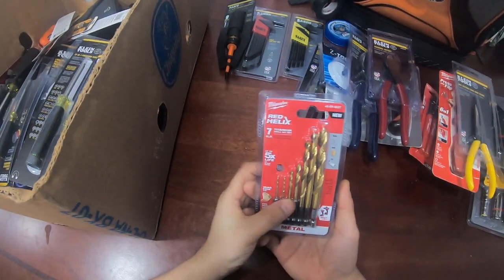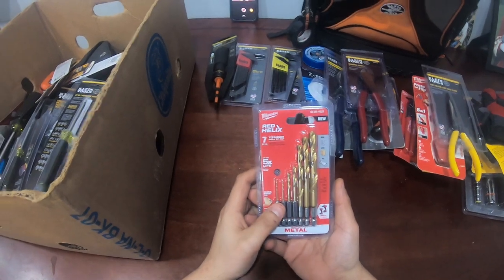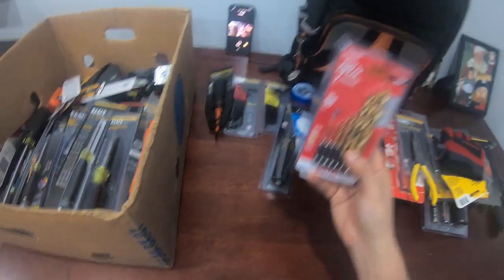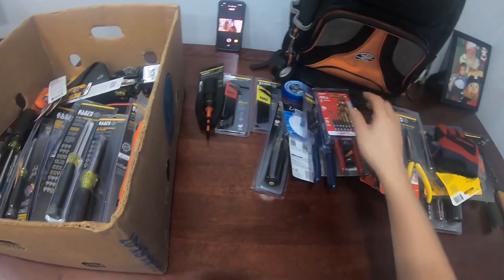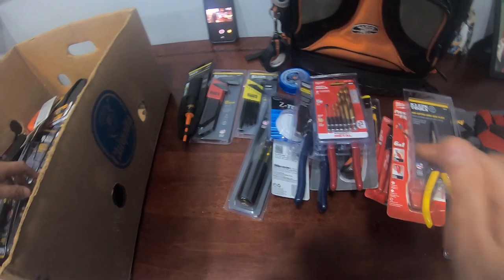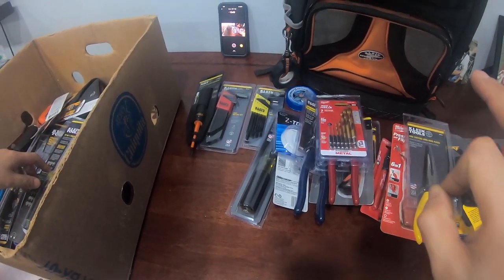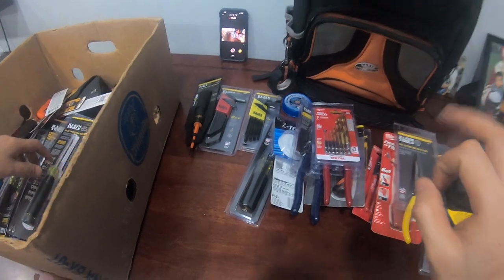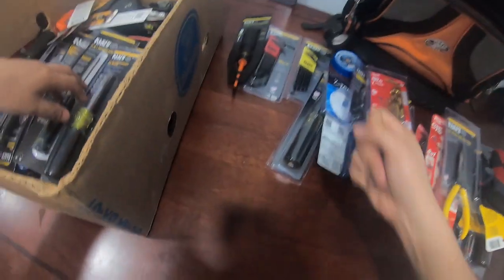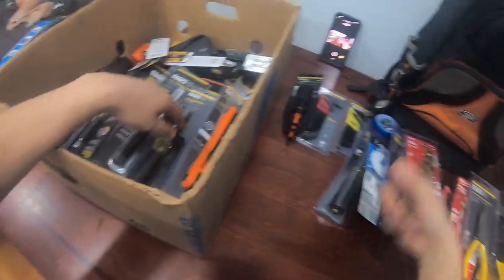An assortment of drill bits — you never know when you need to make a starting hole or a small hole for whatever reason. I keep a simple set just in case. I always do a starting hole before using step drills, because after a while the tip of a step drill becomes dull and you're just wasting time trying to drill through. A quick starting hole makes it a two-second job.